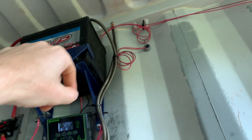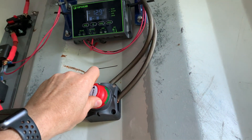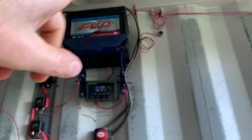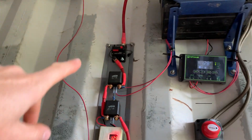The master cutoff is on the ground — from the ground of the battery through this master cutoff, then grounded to the container. That's how I shut the whole system down. I'll turn that on, and now you can see that grounds everything, so now things come on.